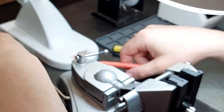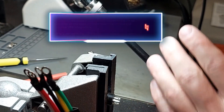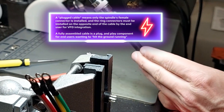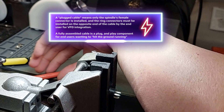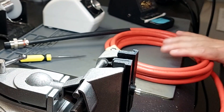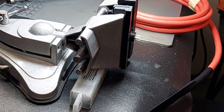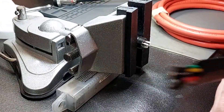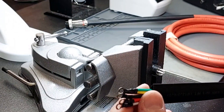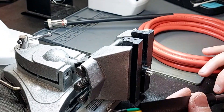I hope this video has been helpful — it's been more visual to show you what to expect and why the connectors and cable assemblies cost what they do. I have guys that'll request a plug cable, meaning only the connector half of the cable is completed. A fully assembled cable includes the ring connectors. These are active cables — it means they're in movement because most of you are going to put these inside a cable chain. Anytime this cable is in movement, your conductors are actually moving. That's why this cable is designed in an ultra-ultra-flex format with interior cotton separators between its conductors.